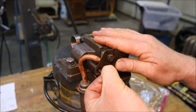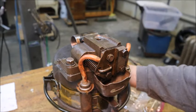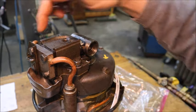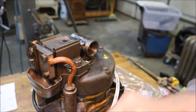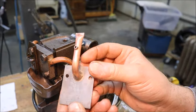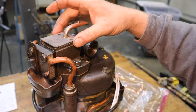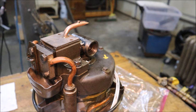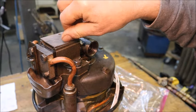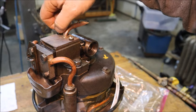When this picks up speed that'll push out and allow the compressor to load itself and begin pumping against compression. Before that pushes out the motor will run but it's not actually doing any compression - it's just venting through there. This port on top is part of the pressure lubrication circuit after the relief valve, and it has this jet that goes on top. This is what actually jets the oil up into the bottom of the dome to operate the oil cooler. It has two little screws that go in it.